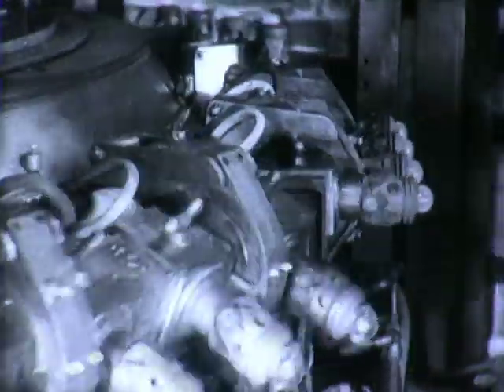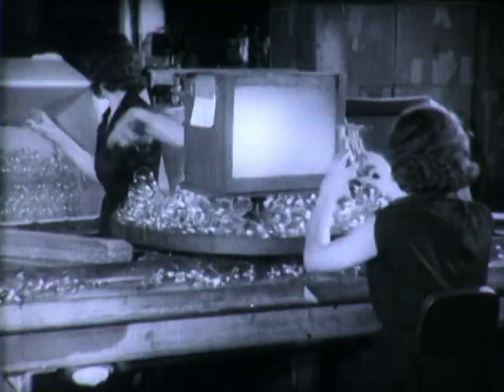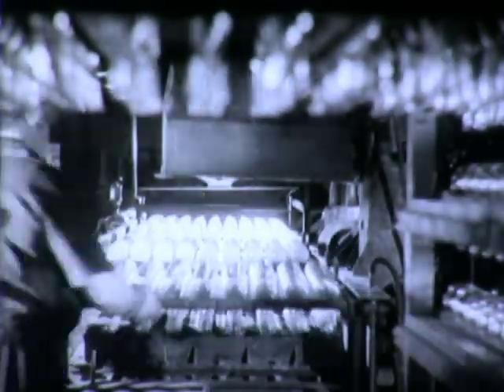Spinning and turning, the glass begins to drop and form, while molds, through which compressed air is blown, encircle it. Actually, the bulbs are formed against a cushion of steam within the molds. As the molds open, they discard their perfectly fashioned bulbs, and then a conveyor belt carries them to a selector, which in turn feeds them to another unit where blades of fire trim their necks to just the right length. Every bulb is inspected for such glass defects as blisters, bubbles, and strains. The perfect ones, on the revolving tray, are ready for inside frosting. Here you may see it being done as tray after tray of clear bulbs is fed into this electrically controlled machine.